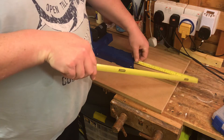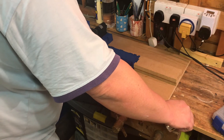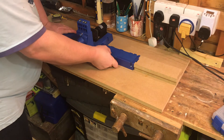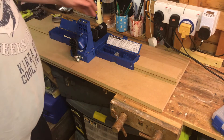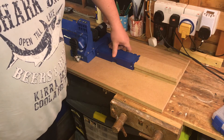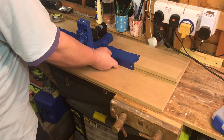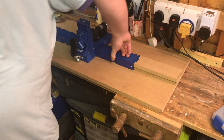So this is my extended pocket hole jig setup. The additional MDF wings on each side are 210mm wider than the standard, which makes the overall width 1 meter and 20mm — gives me a nice stable base for larger stuff. We've got the pop-up sections here. One thing to note: sometimes you push that down and it feels like it's done up but it's not — it flicks open. You've got to listen for a positive click, because I'm going to be turning this upside down to hang between rafters. If I don't do this properly it'll flip open and everything will fall out.